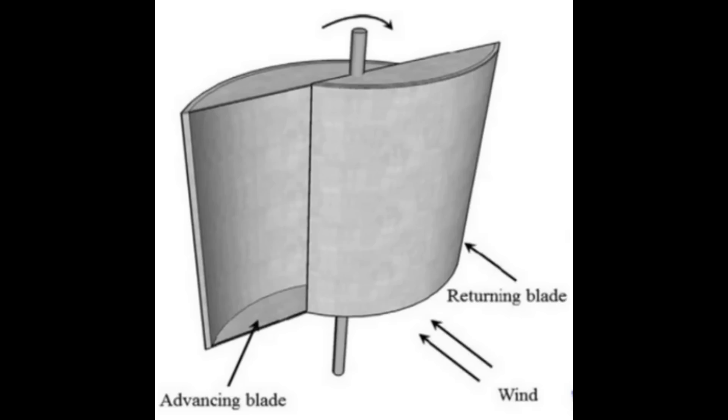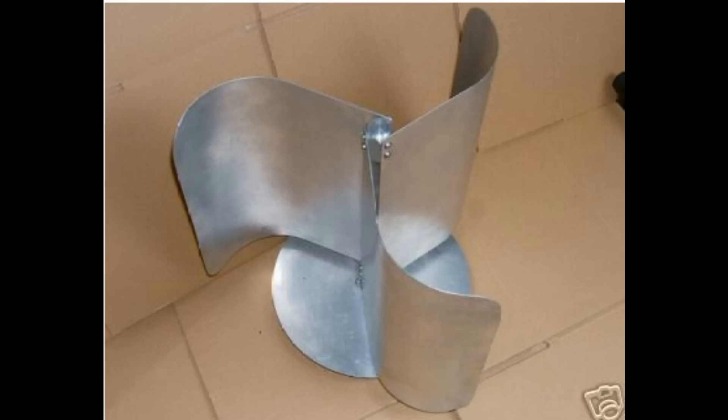It does have its problems — it's not terribly efficient. One of the reasons is when the blades are full on to the wind, they capture the full force of the wind, but they rotate. When they've rotated 90 degrees, you've got the edge facing the wind and you lose a lot of that power, relying on inertia to take it round a little bit further. People have tried to solve this by adding extra blades, but research has shown that three-bladed Savonius turbines are the maximum improvement from adding blades, so the two-bladed version remains the standard. Adding blades doesn't have the return you would think.